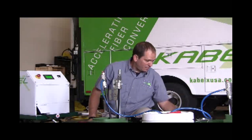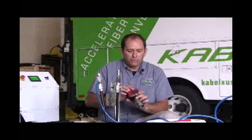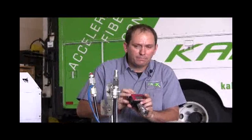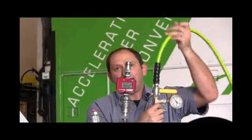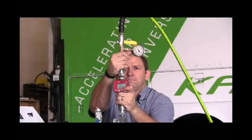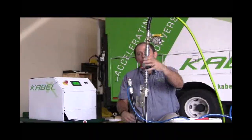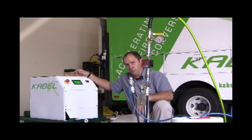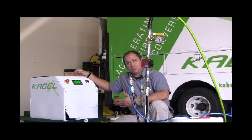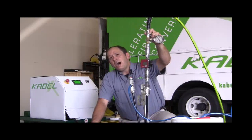We're ready to extract. To extract, we want to monitor our fluid consumption, so we're going to put our flow meter inline, reset it so it's ready to go. We install it just by pushing on there really quick, and then the next piece is our hose off of our pump. My pump's been preset at 465 PSI, which is about the working pressure for this cable. It's already pre-charged, so I'm going to crack the valve open to look for leaks. If I don't see any leaking, I'm going to let it keep going.